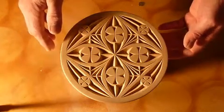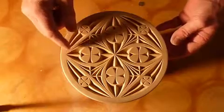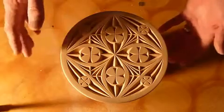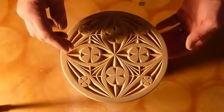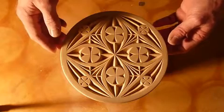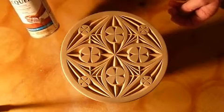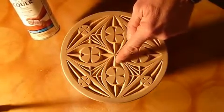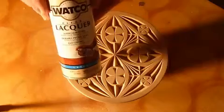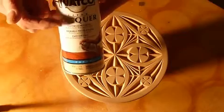Using a shellac-based sanding sealer for the undercoat, we can apply either a lacquer or a polyurethane to the top. I prefer a lacquer for a couple of reasons. One, it's fast drying which means less dust will dry on the surface. And second, it does not yellow over age like polyurethane does. From this point on, we'll be spraying on a finish. Do not brush on a top coat finish — it will puddle in the bottom of your carving and it will not look very good. This is a satin lacquer finish. Don't use a high gloss finish — always use a satin.